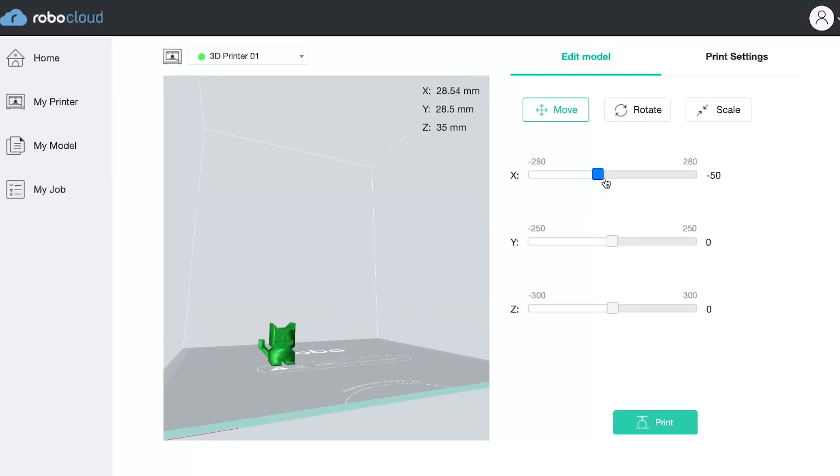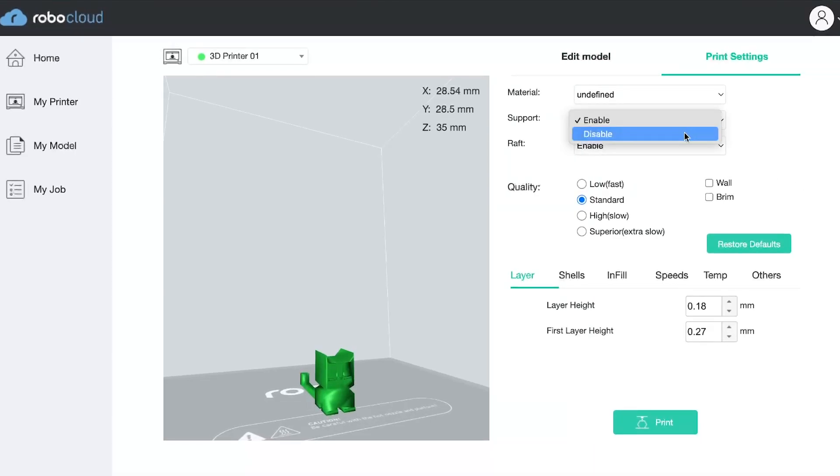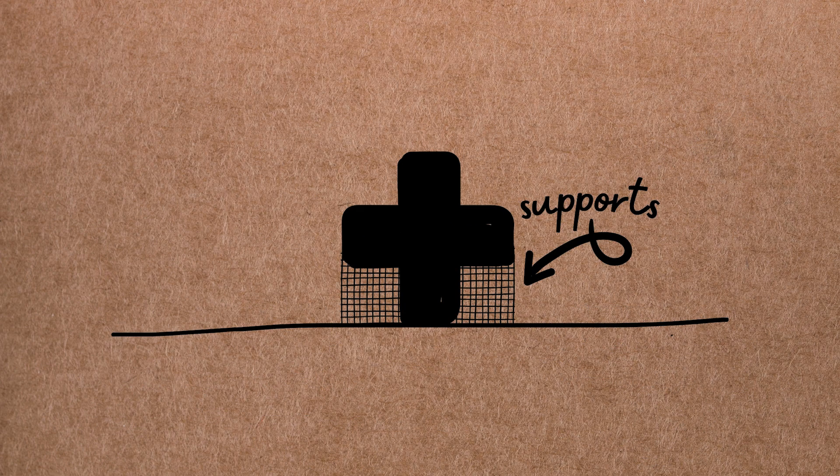Now you can preview your print. There are also controls for moving, resizing, and rotating your print in this menu. If your print doesn't fit within the machine's printing area, the model will show that in red. When you're happy with your preview, click into the Print Settings tab for some final tweaks. Remember the workaround for top-heavy prints and overhanging parts? Support is the setting that can help — if you select Enable under Support, the computer will generate scrap plastic scaffolding under any problem areas. Keep in mind that this scaffolding will consume additional filament, take extra time to print, and must be manually cut or filed away from your final project.